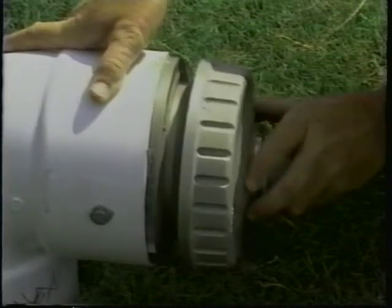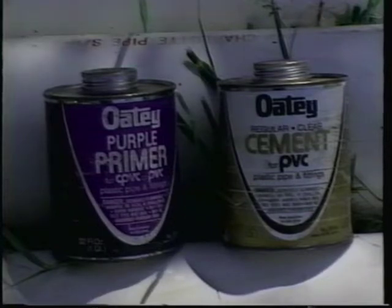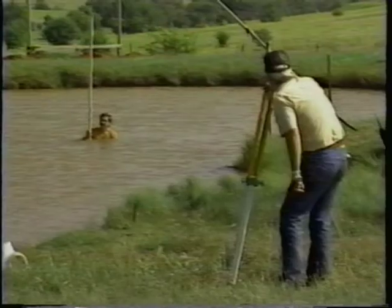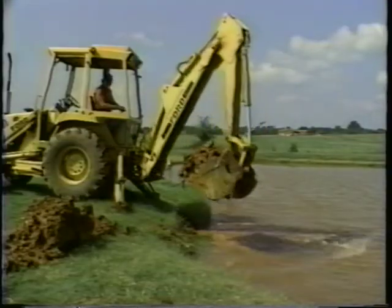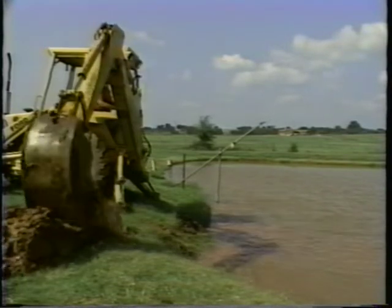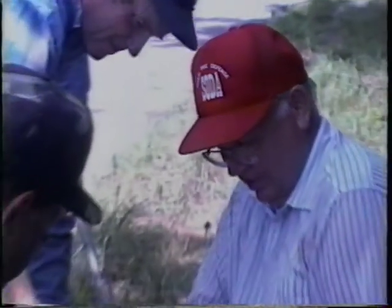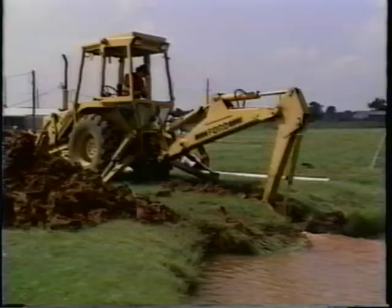Usually the head assembly involves a 4 to 6 inch coupling. The PVC glue or adhesive should specify for a large diameter pipe. A pipe support is necessary to stabilize the strainer end of the pipe. Installation is usually a cooperative effort that includes the use of county commission equipment, so an agreement between the landowner and the county is necessary for installation and maintenance. The local fire department can supervise installation of the dry hydrant, which begins with the use of a backhoe to dig a trench.